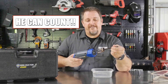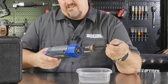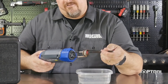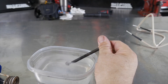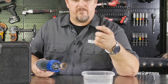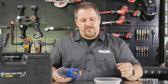One, two, three... [counts to 20] ...and you can see it's starting to get cherry red there, just about red hot. And you can see I'm still holding the other end of this. So this is now cherry red. In fact, I can get down pretty close, and it's starting to get warm right there. But you can see that I can hold the other end, and this side is still cherry red. It typically takes about 20 seconds on a half-inch bolt or half-inch head bolt.